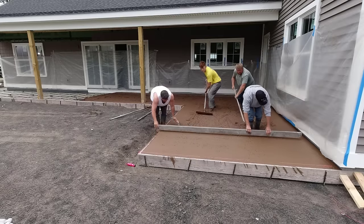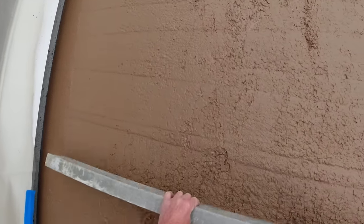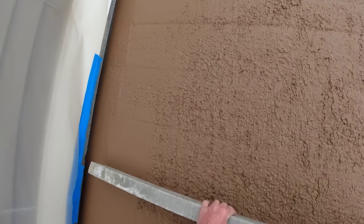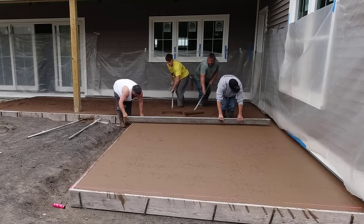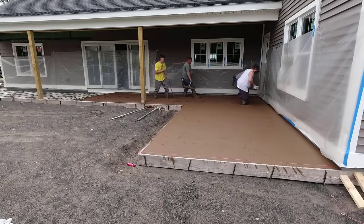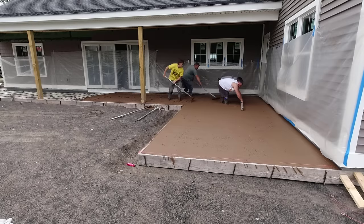That's how we kick-screed right there. This is about five and a half to six inches thick total. We put some ICFS isolation expansion joint up against the house slab foundation to keep this slab from sticking to that one — if something wants to move independently, it won't chip and break up. It slopes about an inch away from the house so it sheds water really well, even though most of it has a roof over it.